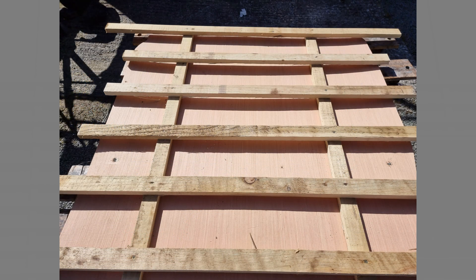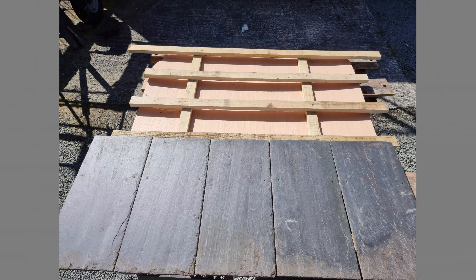This image depicts a mock-up of battens and counter battens on a typical SIP panel roof. To aid easy disassembly of the temporary test panel, a few slate tiles have been secured with wood screws, but the bulk are just loosely laid in position.